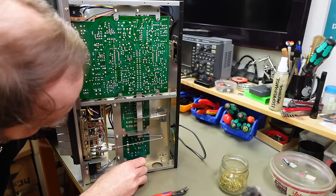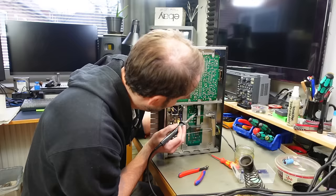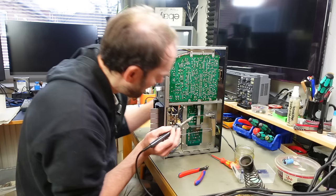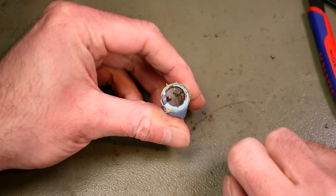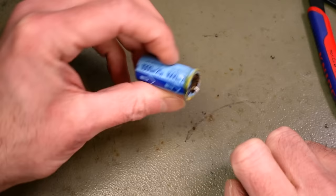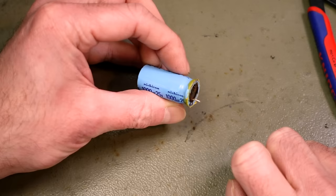These are glued in — you want to glue them in for devices that naturally move during use because they have motors. The leaking capacitor seems to have corroded the pads underneath as well, so we'll have to do some cleanup. This was definitely a leaking capacitor — it had a slight bulge and the positive lead is completely corroded away, so it was only held in with the negative lead. This didn't do anything to filter the voltages, which probably was a problem. I hope nothing else got damaged down the line.